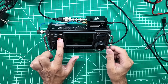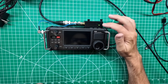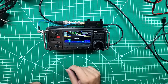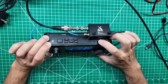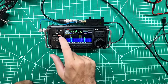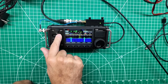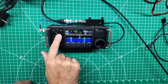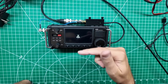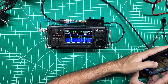Now two moments of truth incoming. One: does it have a charge on the battery? It looks like it does. Two: does it say WR12 when it boots up? We've got power through the USB device. There it is — WR12. And we're getting that power-on init message, which usually means I've got Bluetooth or Wi-Fi enabled. I'll turn off the tuner because it's a receive antenna. Wi-Fi is off, Bluetooth is off — let's do a reboot. It came up faster, but it still says WR12, so that power-on init was because of the Wi-Fi and Bluetooth.